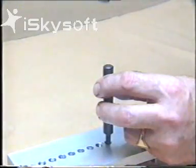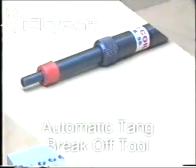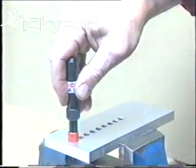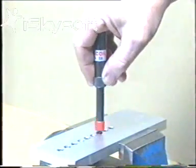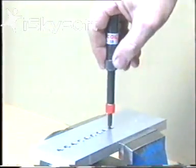On a screw lock insert, the TBO has to pass through the locking coil. Do not try and force a punch through it. Automatic tang break-off, or ATBO, is designed on the principle of the automatic center punch. It snaps off the tang when the body is depressed. A spring-loaded slug is fired onto the end of the punch. The resultant force breaks off the tang. On high volume production, use ATBO after a batch of inserts have been installed.